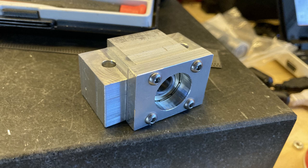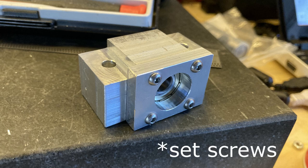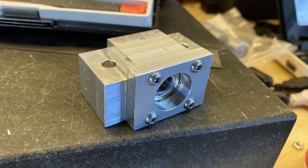Once you put the lead screw through the bearing, I have two different collar nuts that I have to cinch up, trying to get them compressing inward as tightly as possible. It's kind of an awkward thing with a couple wrenches, and those have lock screws in them. I tighten the lock screws while also trying to compress it to preload it. Then if everything works right, I put the indicator on it and check for backlash. This is a little more finicky, but it does work. I ended up with virtually zero backlash, which is great — certainly less than I could measure with my thousandth indicator.